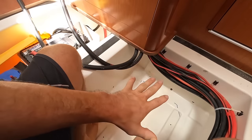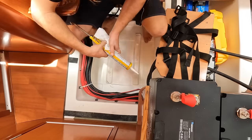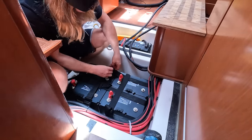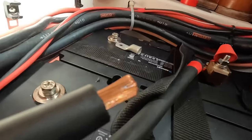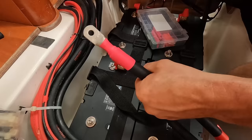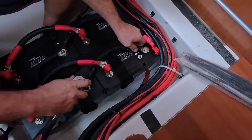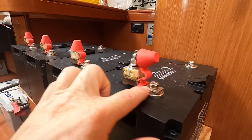Find a suitable place to install your lithium batteries. We made a base to strap them in and put them under the floor in a bilge that never gets wet. Keep in mind you want them in a spot with the shortest cable runs possible and adequate airflow, because things can heat up and these cables are quite thick. We use 3-ought gauge cables because our runs are all under one meter. We made all our battery cables the exact same length and installed 100 amp battery fuses on each terminal using these terminal fuse blocks.